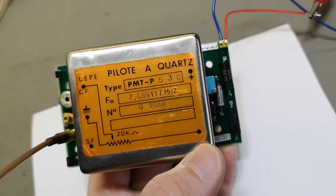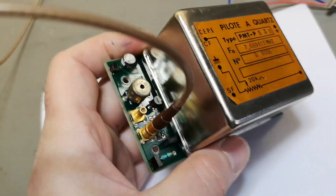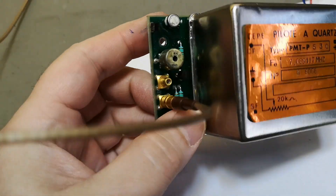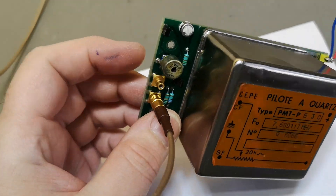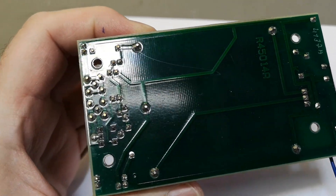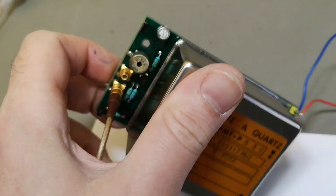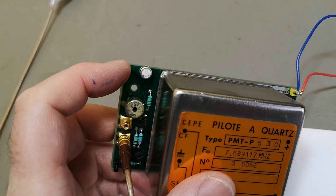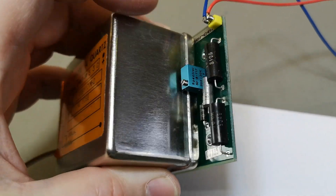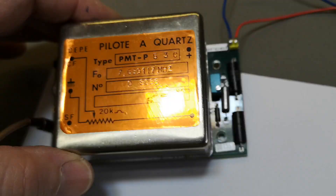It also says here on the text what is positive and ground, so it was easy to figure out polarity. There's a really nice RF connector — they are impossible to pull. There's an inductor; I think this is a balun or a power splitter, so you get the output on two connectors going to this inductor or transformer. There's also a little transistor driver and a trimmer for the level. This other trimmer is to fine-adjust the frequency — it's the center frequency fine-tune control.